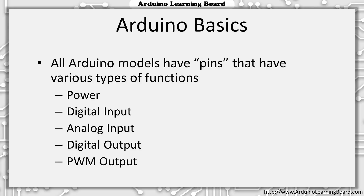Digital signals, either inputs or outputs, are signals that can either be on or off. In a 5-volt Arduino, the on or high digital value will be 5 volts. On a 3.3-volt Arduino, an on or high digital value will be 3.3 volts. In both cases, an off or low digital value will be 0 volts, or what we also call ground. An analogy for digital signals is a simple light switch — if the switch is on, the light is on; if the switch is off, the light is off. Analog signals, on the other hand, are like having a dimmer switch. You can still have full on or full off, but you can also have many different values in between. In Arduino, we typically can represent 1,024 different values between 0 and 5 volts, or between 0 and 3.3 volts on a 3.3-volt Arduino. We'll see this soon when we experiment with a joystick project.